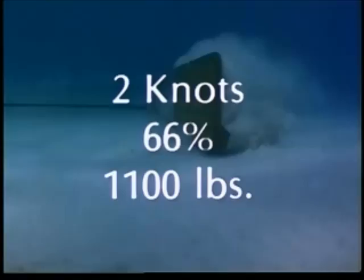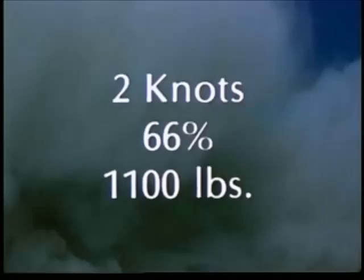The performance characteristics of a 50-foot flat net with 7x36 doors at 2, 2.5, 3, and 3.5 knots demonstrates the variability in performance at different towing speeds. At 2 knots, the net foot rope is fishing on the bottom in the center and 4 inches in the wings. The spread is 66%, the towing tension is 1,100 pounds, and the measured fuel consumption rate is 2.2 gallons per hour. At this speed, the doors are unstable, and the net is fishing hard on the bottom.